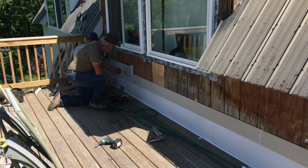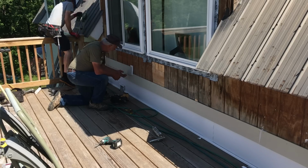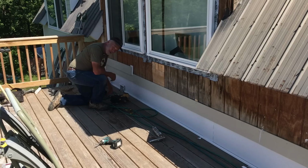We were finding that there was some bounce, and we had the salesman come and look at it and talk to us. He says that's the way it is. It needs to have that breathability underneath here. And it says, do not, I repeat, do not, as in don't, ever, never, cardinal sin is what I had heard, caulk under here to close up that joint. Painting is apparently fine when you seal that up. The paint, I'm not sure why, but it's okay. So that's the way we are going to proceed.